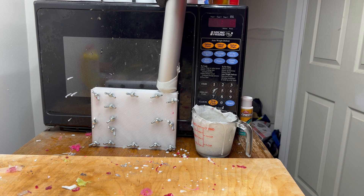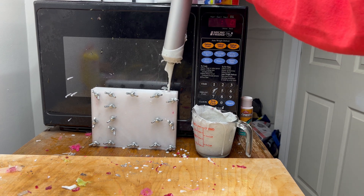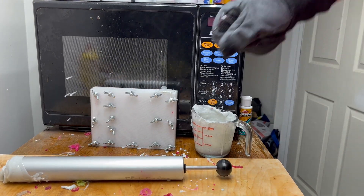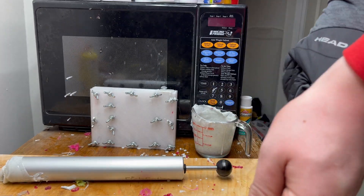I'm going to put a lot of pressure on this for a decent amount of time, just to make sure that tail fills up fully and none of that plastic sucks out of the tail when it cools down. I held that for a really long time — I don't think it's necessary for that much, but better safe than sorry. We're going to let that cool off and I'll see you guys when we're ready to demold.